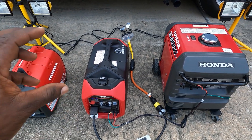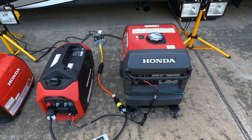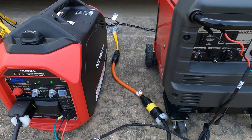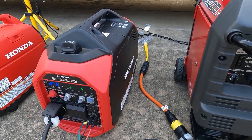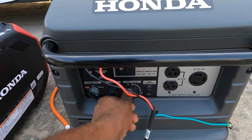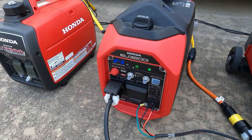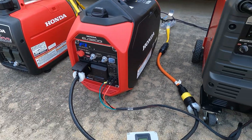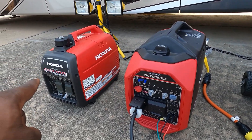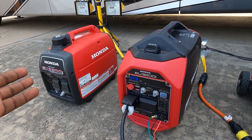There's a deeper tone to it. There's no surging, no raising of the RPMs — it's just smooth, smooth operation. This one you can hear spiking every time you get some new load. Let's shut this one off and switch it to the other one. When it comes to these two, they work great together. Let's try this with the 2200 now. Remember we got 4,000 watts with those two — let's hook it up to the 2200 and see what we can get.